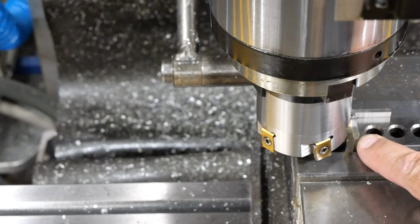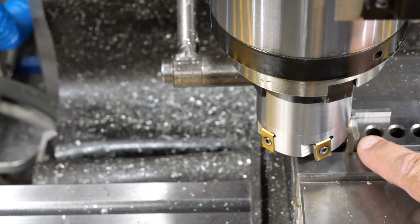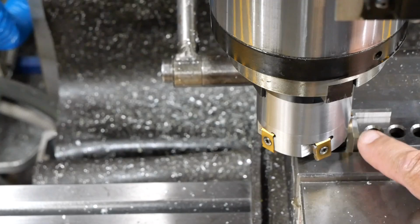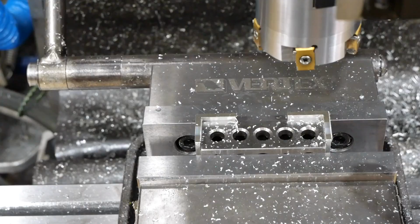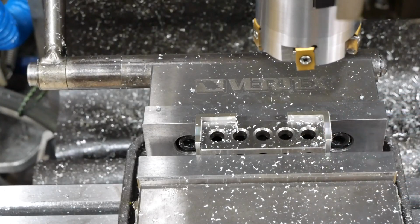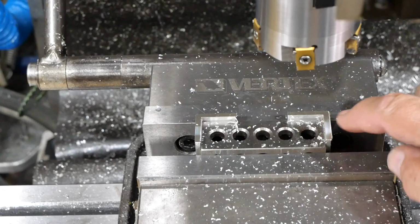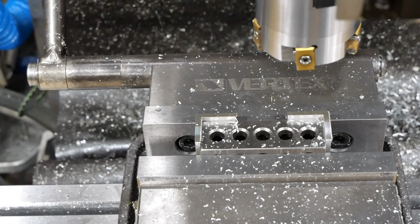The correct length is 54, but I'll come back and sort them out to their final length when I've decided what to do with the crankcase. So this is just a 0.68 depth of cut, just to bring them to 55, and then I'll park them for the time being. So this is my home brewed cutter. It seems to clean up pretty nicely on aluminium. It's a very fine surface finish. Anyway, so these get parked now, and we'll bring them back when I've decided exactly how long they should be.